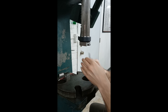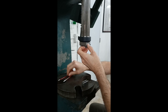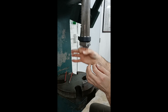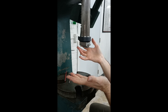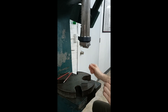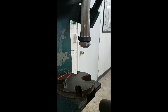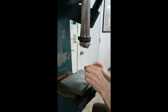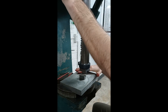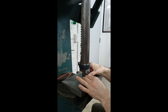The other alternative I was thinking is we could do a similar thing with a die shoe for a punch press machine. You could actually put one of those in your arbor press with something like this, where instead of bolting a square fixture, you're bolting a round plug - super simple, like everybody uses for pushing bearings in and out - and that plug would attach to the top of your die shoe. What we're going to do, because we just need the square die rectangular die setup, is probably put some kind of basic heavy fixture plate on the bottom that the bottom die gets mounted to, and then you make your alignment to the ram.